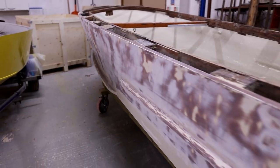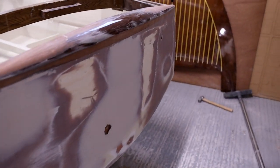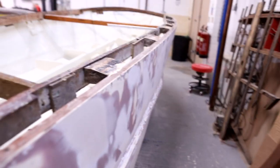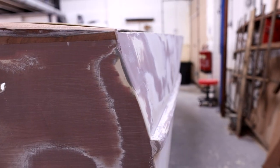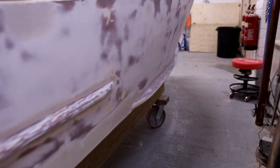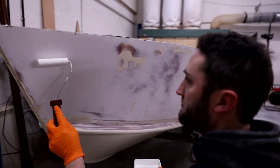I just need to do some last little bits of filling to get that transom nice and fair. It took a bit of work to get it back to shape but it's a hell of a lot nicer than it was before. Once I get some paint on that you'll be able to see the improvement. I went around the whole boat giving it a little more fill and fair in various places. We did some of this when the boat was upside down but right-way-up we've got a much better look, particularly on the spray rail sections.